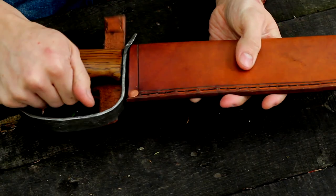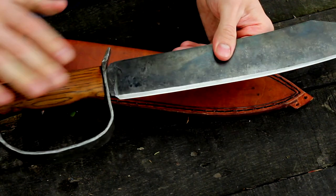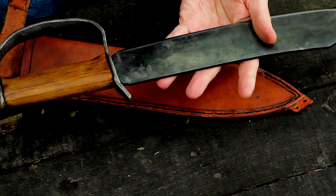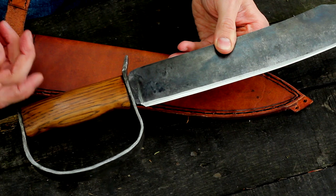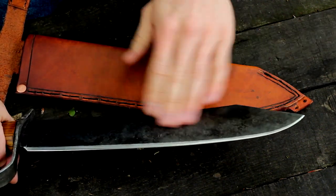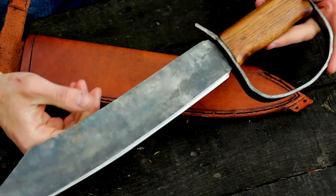Here's a closer look at the knife. The customer contacted me looking for a Hudson Bay type blade, which is what I've done here on a D-Guard. The handle is hickory — he chose the wood type from what I had available, which is a good choice. It's a rugged, durable wood with a real nice grain. I stained it with a mild wood stain and then put some linseed oil on top, because the oil finish is going to look better. The blade has got the patina from the quench and the temper, so it's got that rugged woodsman trapper kind of look to it.